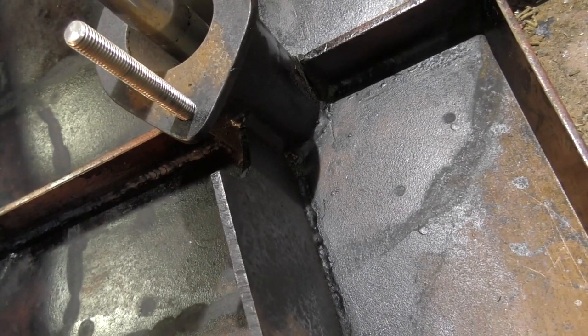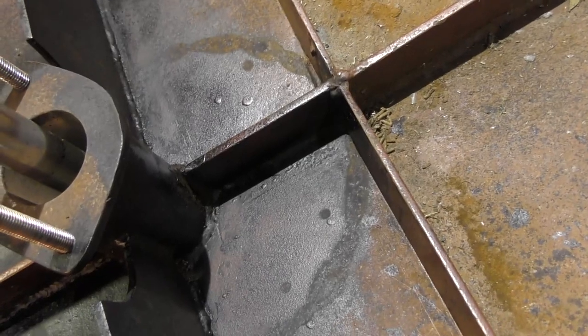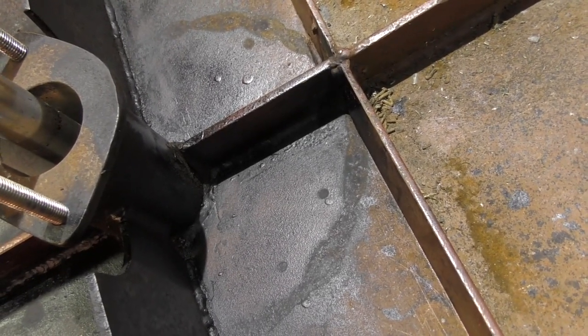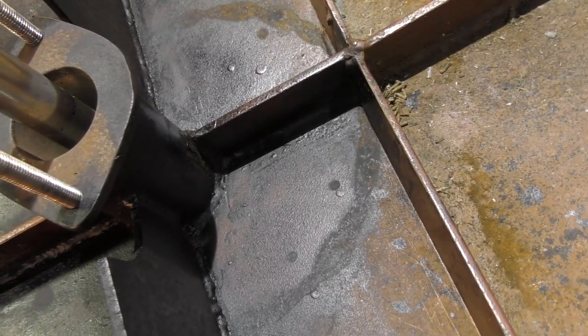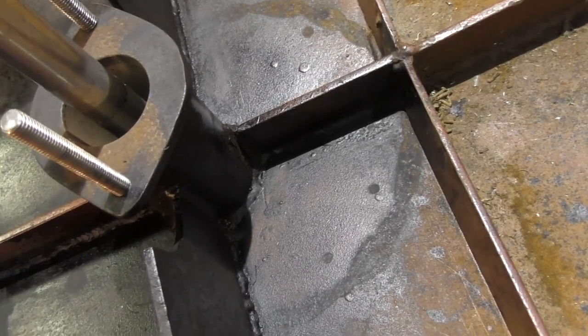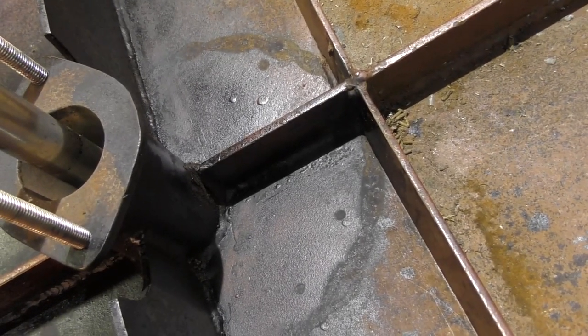What I'm going to do first is make up a couple of braces — tacked and welded to the profile bar on each side, and another tacked for the web plates across the span of that web plate, across each side of the rudder post. Hopefully that will line up nice and accurately.